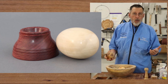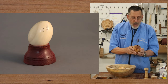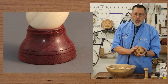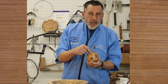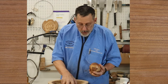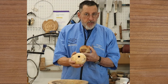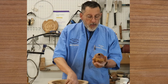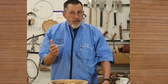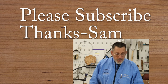I could show you five or ten more examples of using shellac as a finish or as a sealer. I often make a little hollow form like this, and sometimes the wood is still wet. I will put shellac inside the vessel, slosh it around, and seal it that way so it doesn't dry out too fast. Sometimes I use shellac as a sealer on something with a small opening — I may not use shellac as a final finish, but there are options. Shellac is an amazingly versatile finish; it's really a good finish just all by itself.